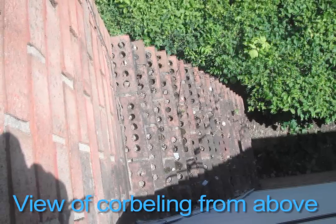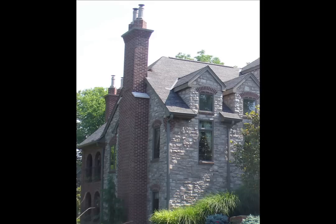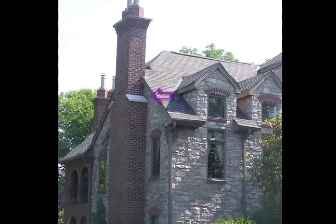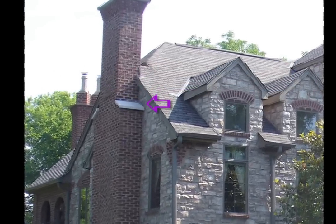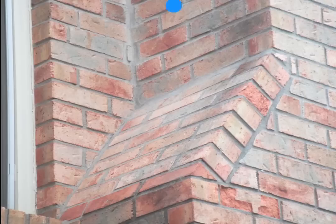These exposed brick holes cause a lot of chimney damage. After the bricks have been scrubbed and cleaned up, a concrete cap or slab can be installed over the stair-stepping bricks. This will create a smooth surface that water will not be able to pool on. Chimney corbels need to be smooth and pitched properly so that water will be forced to shed off the brick surface.